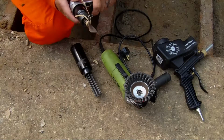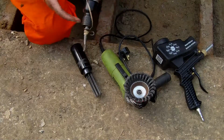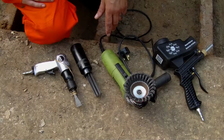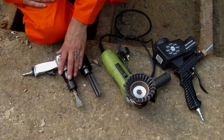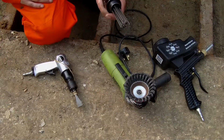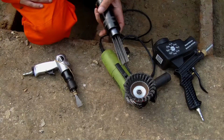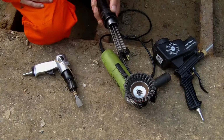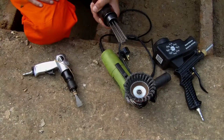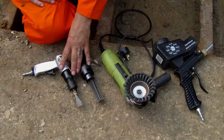And now I've got this, I don't have to put anywhere near as much pressure on it to get the chisel to work. So I'll be starting off with that. Then around all the details and the smaller parts where the chisel can't get in, I've got a needle gun attachment which I fit in, which is good. It's not great for a lot of it, but just those bits around the corners and the details where panels meet, it's fantastic. Gets in there and gives a really good harsh result. So I'll be using those two on the really rusty parts around the waterline.